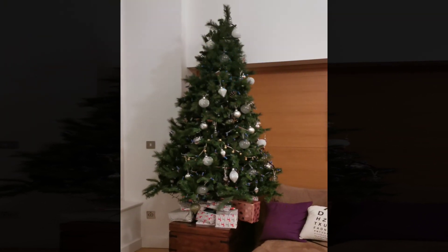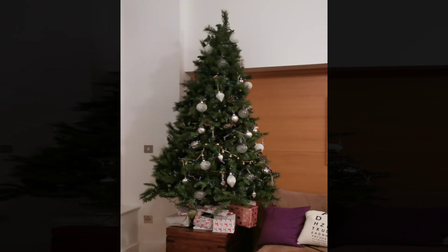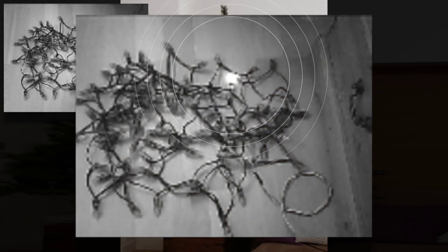This is done using some really simple image processing and a steady hand. We grab a frame from the camera with all the LEDs turned off, and then we light each LED in turn, grabbing a frame from the camera each time we light an LED. We can then simply compare the unlit frame with the lit frame to calculate the approximate position of the lit LED.